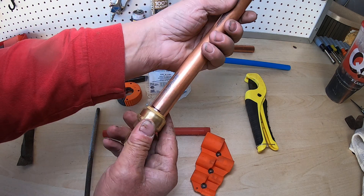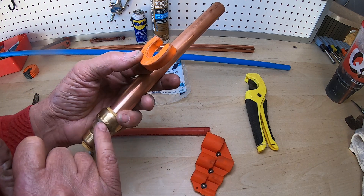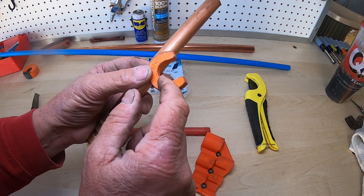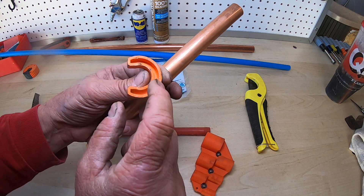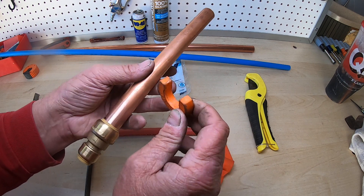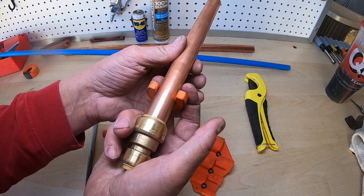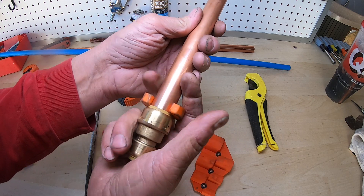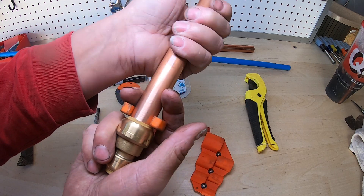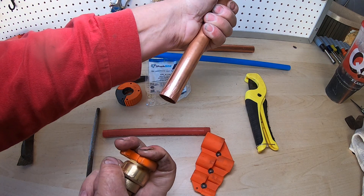If you want to release it, they make a horseshoe-shaped release tool for the SharkBite fitting. On one side it's kind of an open cavity, and on the other side it's flat — I always use the flat side. This will slide onto a piece of three-quarter inch copper or PEX. What you're going to do is pull the copper and the fitting together — I'm pushing with one hand, pulling and twisting with the other. Then I squeeze down and pull the fitting out. Pretty simple.